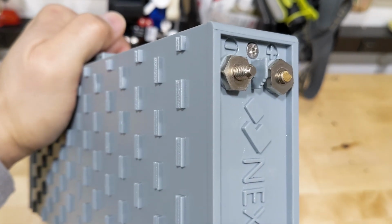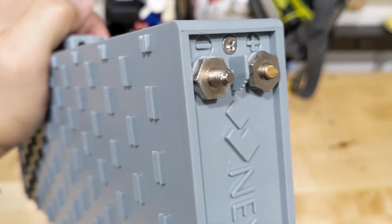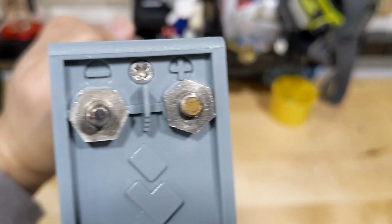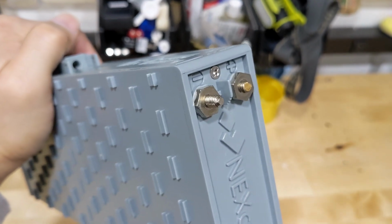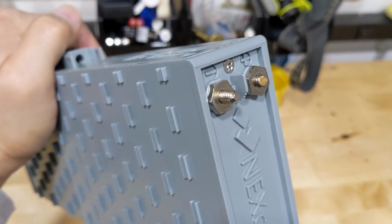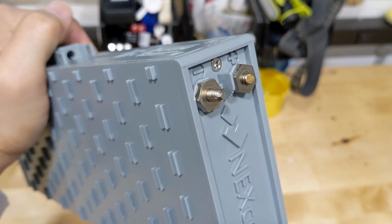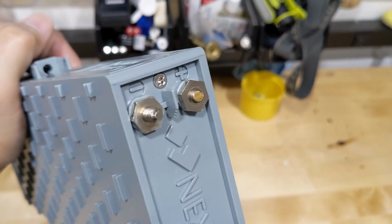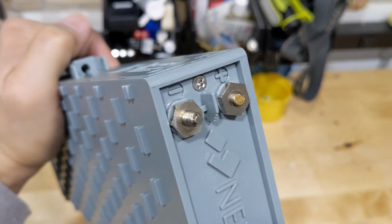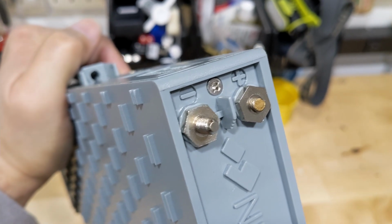So the Nexcell lithium blade, the connector itself is made of copper composite. As you can see, it's copper inside. The advantage of that is it's a very good conductor. Therefore, it can lower the internal resistance and make the battery much more efficient. The downside is it's copper, right? So it's softer than the stainless steel, which is what has been used in the stock battery blade.